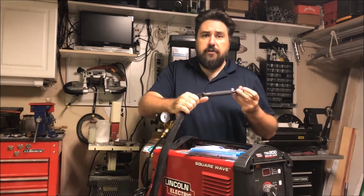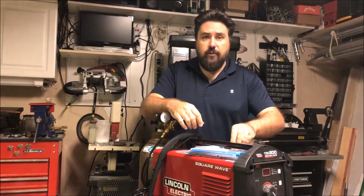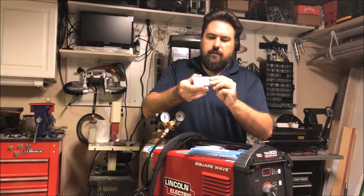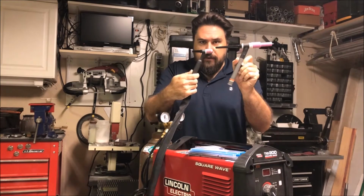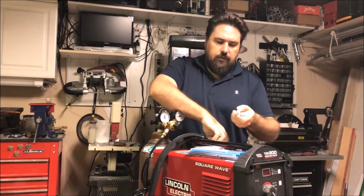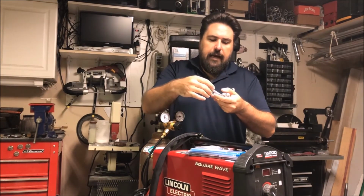So you can definitely do it yourself, but if you're looking for every edge up and just something where you don't have to hassle with it, that's where JSP has come in with this series of electrodes that are already at half length. It's a pretty common size for this small torch right here. As you can see, the size difference, just length and everything. These electrodes are a little over 3 inches long, and they come in a higher count pack.